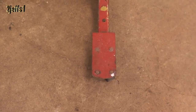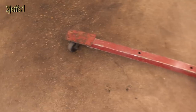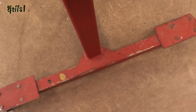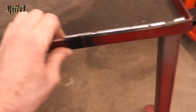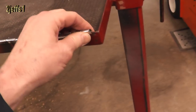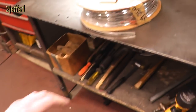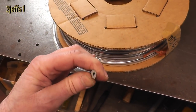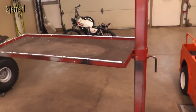The feet pieces were all the right length and I tacked them on. I didn't even have to touch them other than drilling the holes for a 2-inch caster I got on these things. And then they had these little cut-off triangle pieces — put them on there. Perfect. So you don't have a sharp edge on here. This is door guard molding. From stuff back in the 70s, this was real common. I got a roll from the body shop — it's slit. You can just pry it open a little bit, put it on your sharp steel edge, and then you've got a non-sharp steel edge.